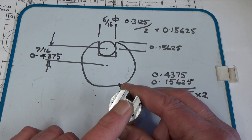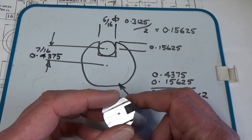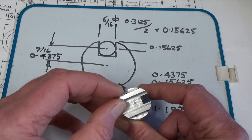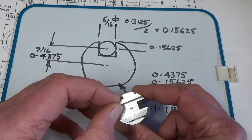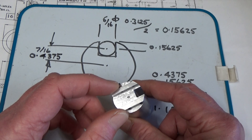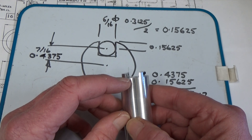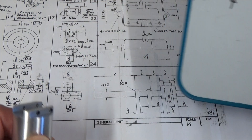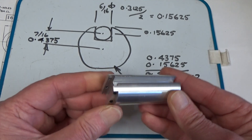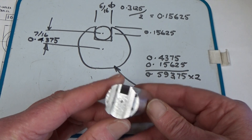This width here is half an inch on mine — the drawing calls for 7/16ths, but I've decided to make my crank webs just a little bit beefier, so this is half an inch. This thickness is fairly arbitrary — I want it as thick as possible for strength because it's got to clamp against the side of the crank web. The depth is just a smidgen over the finished thickness of the crank web of 3/16ths. So there we go — off to the mill.